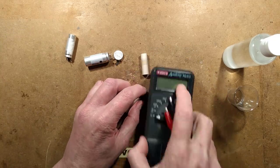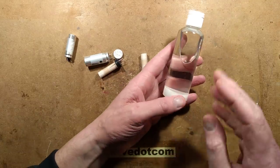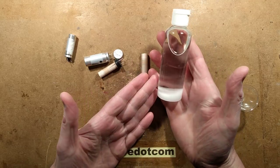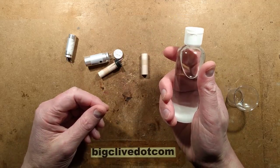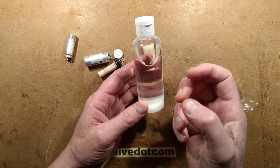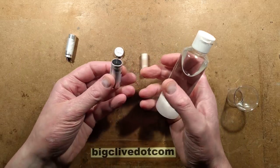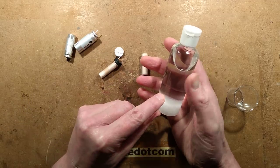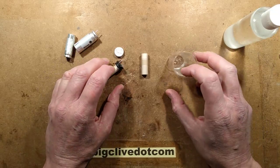It was suggested that I could add the electrolyte, and coincidentally I do have ethylene glycol and boric acid. I've made a saturated solution of it just by dissolving as much boric acid in the ethylene glycol as possible, but that's not necessarily how they do it. The ethylene glycol will probably only be able to hold a certain amount at room temperature, and as it gets colder — if these capacitors are used in very low temperatures — the boric acid could theoretically crystallize back out inside the capacitor. I'm not sure how that would affect it; it could theoretically break through the separation layers.